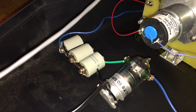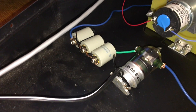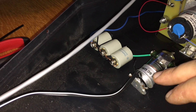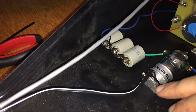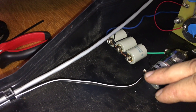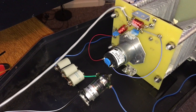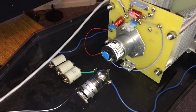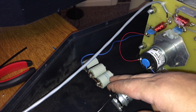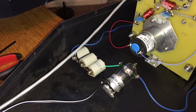I bought the vacuum relay from Russia. It's a 24-volt, 5-kilovolt vacuum relay, and I have a 24-volt coil here. You add around 150 picofarads to the big capacitor, and this way you can tune down to 40 meters.